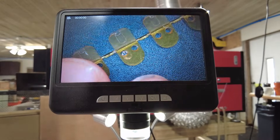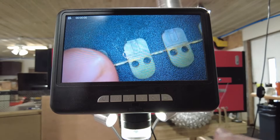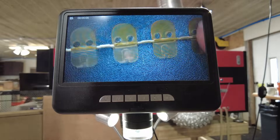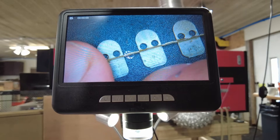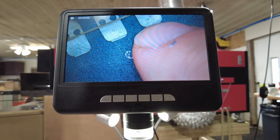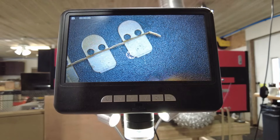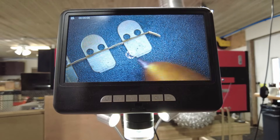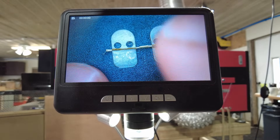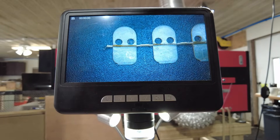Otherwise, all of our features are there. These are nice and transparent at this thickness. Backside finish-wise is looking pretty good. That little step is there. That corner right there is also nice and tight — that was cut with that 10 thou end mill. So now it's just a matter of getting the tab off and checking these dimensions.